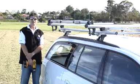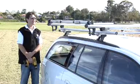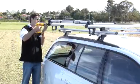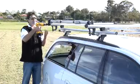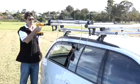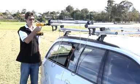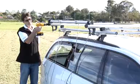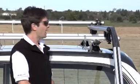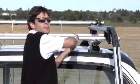Now you've connected your short ropes, you now need to connect your long winch ropes. To do this, loosen the winch ropes by connecting the drill to the drive shaft and simply loosening. Now that we've loosened the winch ropes enough, disconnect them and connect them to the eye bolts on the far side of the boat.